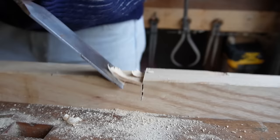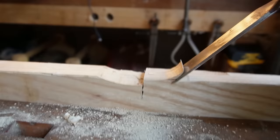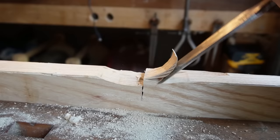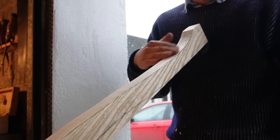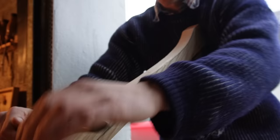So once I'm happy with how much I've got from one side, I'll just come around from the other side and do the same thing. Once I have it all roughed out with the chisel, I then come along with the spokeshave and give it a last smoothing over. I also have a metal one, but I find the wooden ones seem to work a lot easier — they don't last as long and wear out quicker, but they definitely slide over the wood a lot easier.